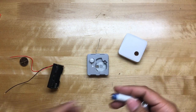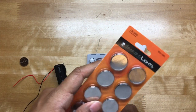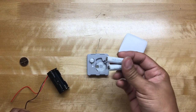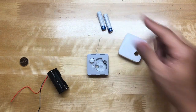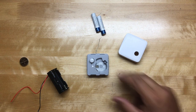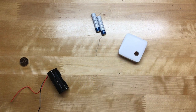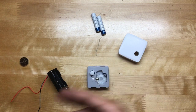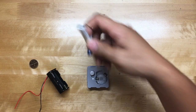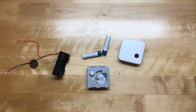We have to make sure the voltages match up. These 2450 batteries are three volts, and two triple-A batteries also equal three volts — that's why we're using two triple-A batteries. The real test will be to see how long these triple-A batteries last, but even if it lasts only a week it's still better than the 2450s, because I can just go to the store and pick up a bunch of triple-As.